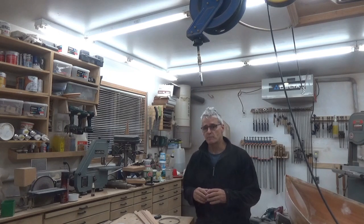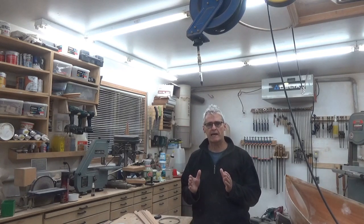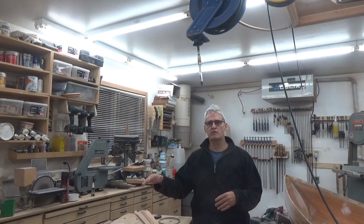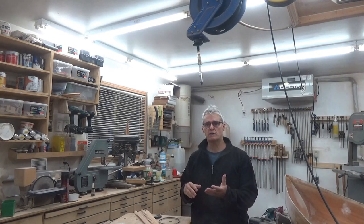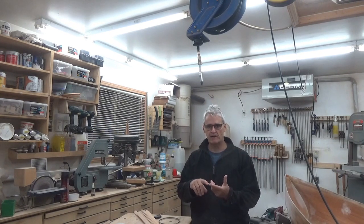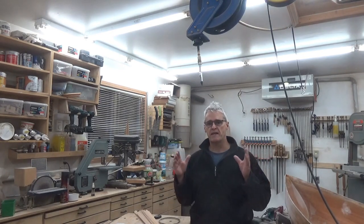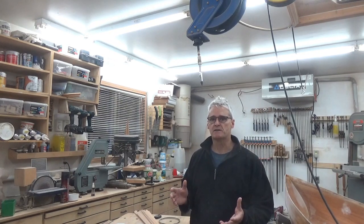What I'm not able to show you is how I actually made the tiller, but it was quite simple. I took a couple of two-by-sixes and screwed them together to get about a four-inch-wide board, marked out the curvature according to the plans, and cut out a mold. Then I laminated five layers of wood: starting with mahogany, then cedar, yellow cedar, red cedar, and mahogany on the outside — all glued with epoxy, left overnight to harden. Once done, I cut it to length, tapered it toward the handle according to the plans, sanded, shaped it, and covered it in a couple of coats of epoxy.